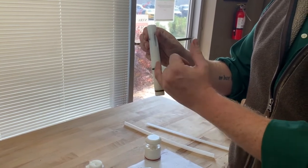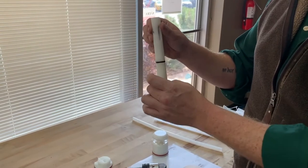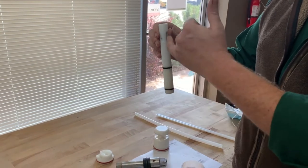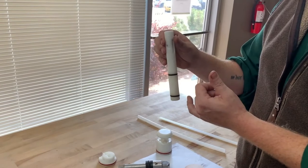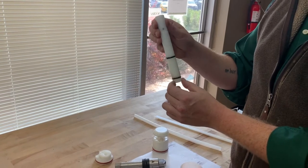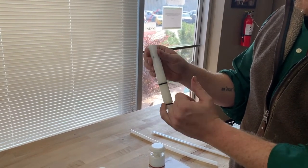And so these, unless it's leaking down from the cylinder and then through here, you don't need to replace these until maybe once a year, every 6 months. But these stay for a really long time. The plungers themselves actually can get worn too. So after many years, like 5+ years, the plungers themselves may need to be redone. And they make plungers that are a little bit bigger from Taylor for special tune-ups. But check that out, and always make sure you're checking your O-rings.